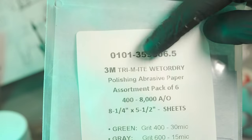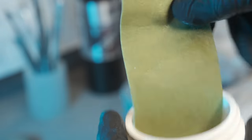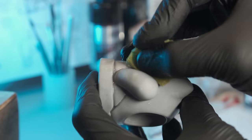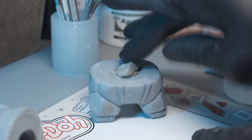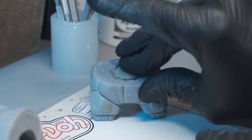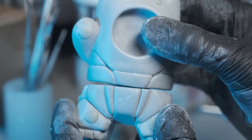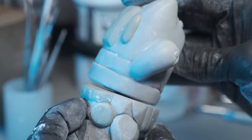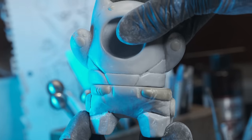And to get into those corners to sand and polish, I rolled up some 3M sanding cloth. I took some leftover epoxy sculpt and stuffed it down into any open holes, any areas we needed to flatten. And now the figure does not meet up together flush, so I ran out to the belt sander. And now we're meeting up true and flush.